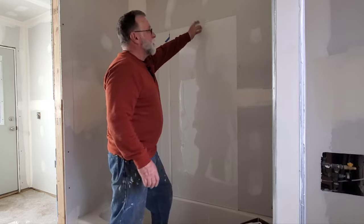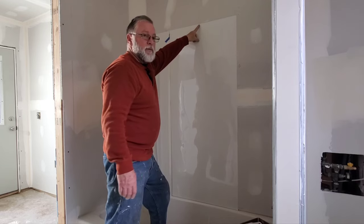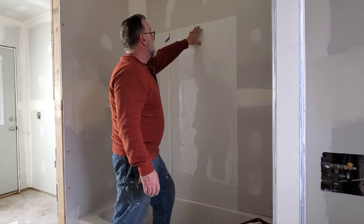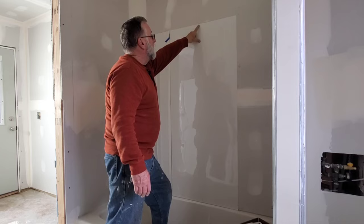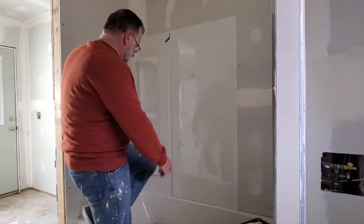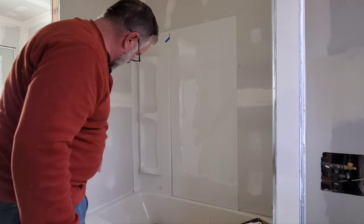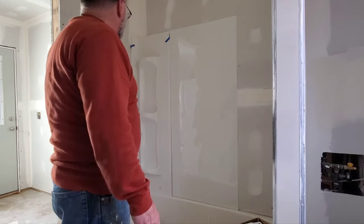So this is how you go: you mark the center of the tub and the center of the panel. Cut it, put a center line back there. There's a film on this too — make sure you get the right side out. You can pull the film off afterwards. Center line to center line, top and bottom, so you don't have it all cattywampus. Don't worry about getting it real tight down there. I did keep my drywall up, so in case some water did seep in there, it wouldn't come in contact. You can see over there it's about a half an inch.